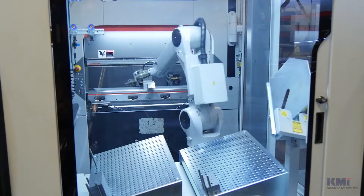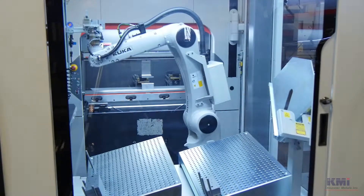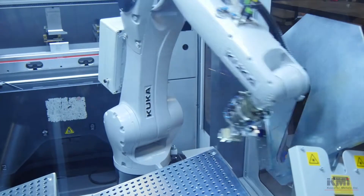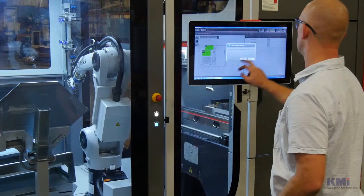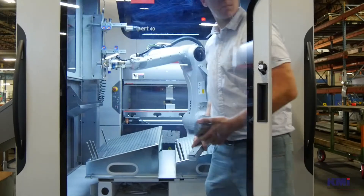When you attach it or detach it, it gives you the ability to run that machine robotically, which gives you offline capacity and offline capability. If you've got repetitive parts — parts that are relatively large volumes of sizes that fit within the scope and window of the robot and the brake press — now you can run a robot in the brake press department and have an operator manage to make sure that machine is running effectively, that it's fully loaded with parts, and they can be bending parts at the same time.